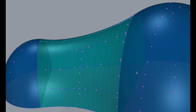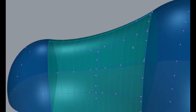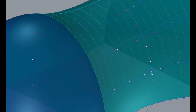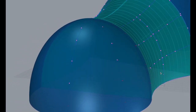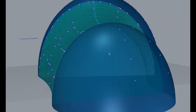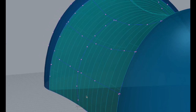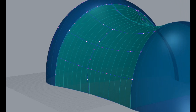Now that was one of the things we wanted to learn, was just how well the baffle is going to help retain that shape. The saddle is doing exactly what we had talked about in the video, where the top has come down and the sides are going out, right? That's exactly what we'd expect. Anything that is inflated wants to be round. So that's what's happened. That saddle has gone round. So we were able to keep the prolates right where they were supposed to be. And you can see on this side, it's really rounded out a lot more than it was supposed to. And so, yeah, it's doing exactly what we thought. So that was the pressure, 2 inches of pressure.